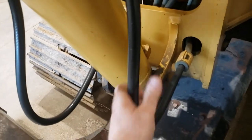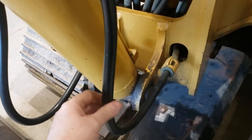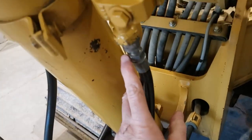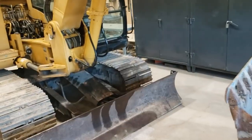On my way by, I'm just going to check this hose — it's a little less stiff than it was a minute ago. Again, that's only a relative comparison. I don't want to go by that before I start taking a fitting off. I want to make sure I've done the proper procedure to ensure that the implement is on the ground and all the weight is no longer pushing on trapped oil inside that cylinder.